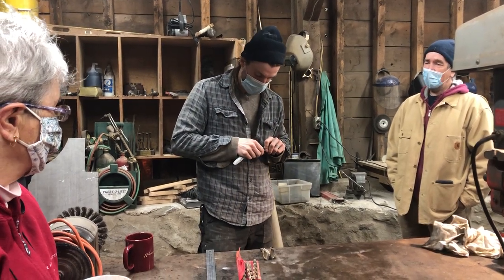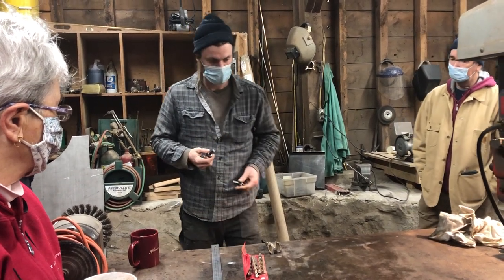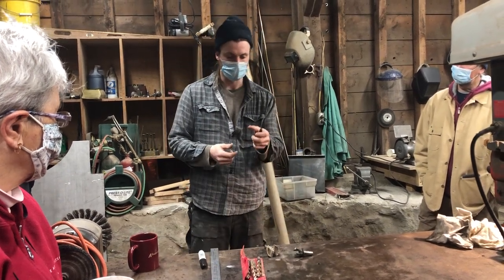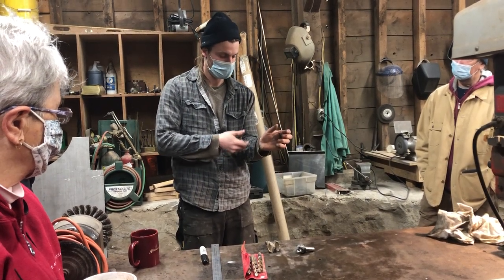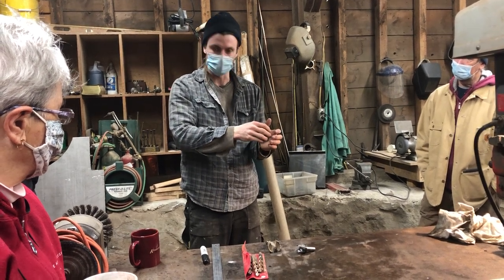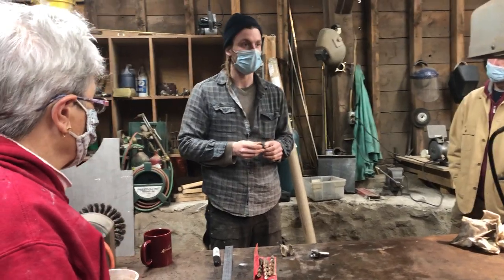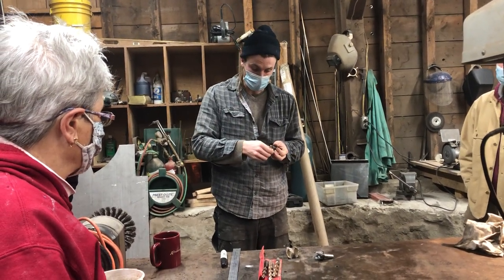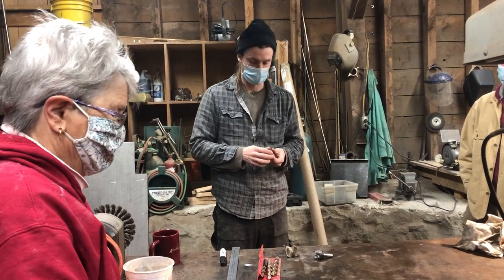So when you're looking at bung cutters, the other common problem is when people undo them from a drill press. If you are not holding on to the bung cutter in your hand like this, and the drill chuck that you're holding and unkeying, then the bung cutter, when it finally comes undone, will drop onto the piece of blade steel that is the bed of the drill press, and then you'll wind up folding over the corners because you've just dropped all four corners nicely on a piece of steel, and it's like that.